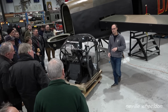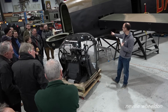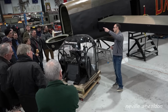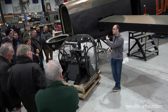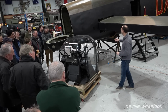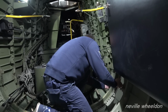Next winter, in theory, is going to be extremely busy, and we will probably get nothing more done than the exchanging of parts. So in theory, provided everything goes to plan, KB976 will come off, NX611's rear fuselage will go on, the port wing of NX611 will come off, the port wing of NX664 will go on, the nose of NX611 will come off, and the nose of W21 will be fitted. So the biggest part we've removed at any one point is the rear fuselage, and that's a ring of 240 bolts. They basically go in the ring around the final former of the rear fuselage, called a transport joint.